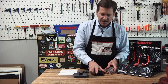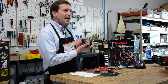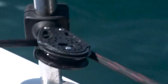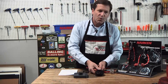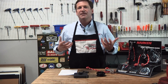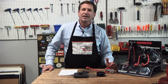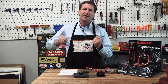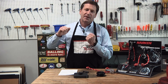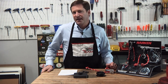With the switchable ratchet, when the ratchet is on, releasing the line will drag as intended with friction over the ratchet sheave. So a spinnaker sheet — an asymmetric spinnaker sheet on a smaller keel boat — where someone is holding the line trimming by hand but then wants to release that line and let that spinnaker sheet run freely is a perfect place for a ratch-o-matic block.